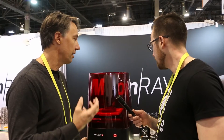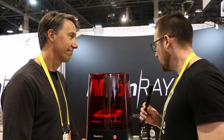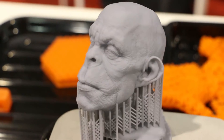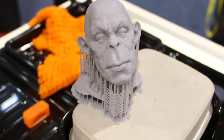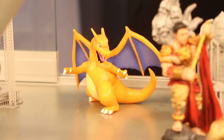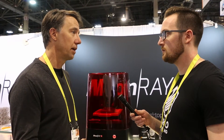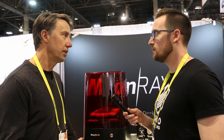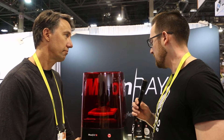So the wear and tear and back-end support on this is very minimal. Are there any differences as far as print quality or print resolution? Still holding the same print resolution — XY at about 100, and Z between 20 and 75 microns — still the same very high-end quality. The big differentiator between us and a lot of the competition is the speed. DLP gives us the ability to fill up that tray and get really good high quality but very fast prints — and that's different from what a lot of other companies are doing at this size, where they'll use a UV laser.